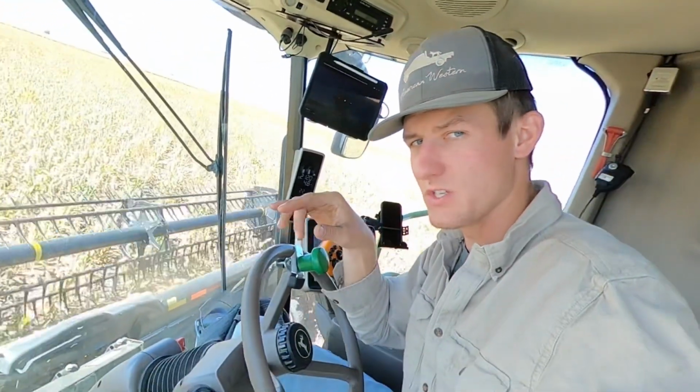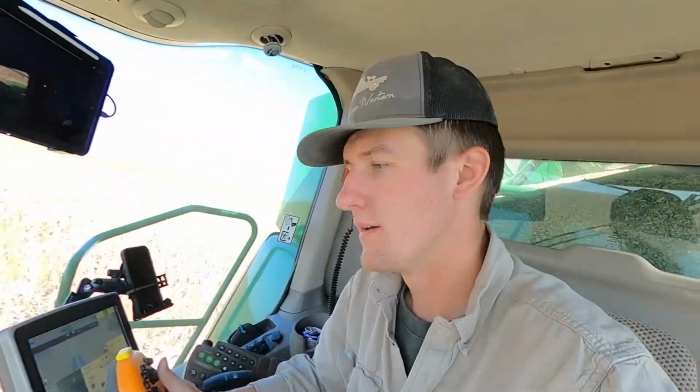Well, if you run at an angle, the crop lifters that we have put on this head and the other head, all of our heads, we run them for Milo only. It'll allow us to pick up crop that is leaning over in the row. It kind of acts like a snoot on a corn head, similar to it, just not as wide, which they work phenomenal, which is why we run them and go at the angle that we do.